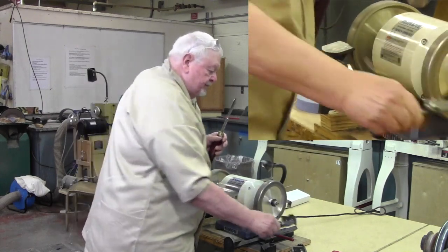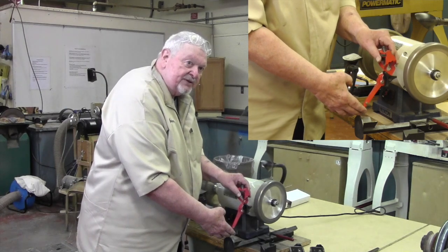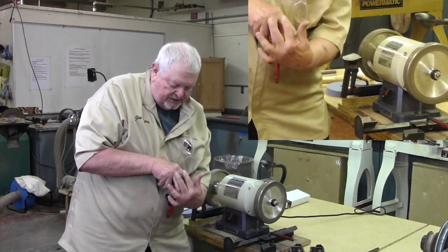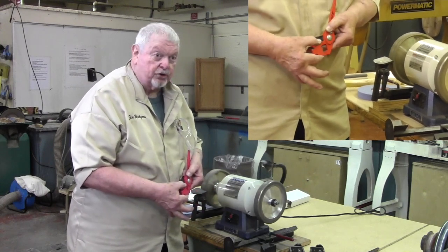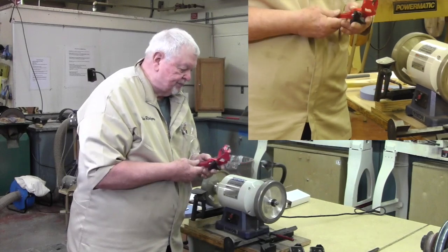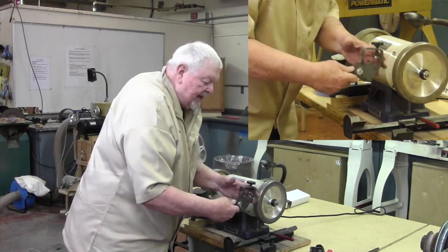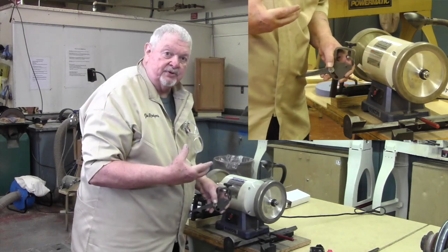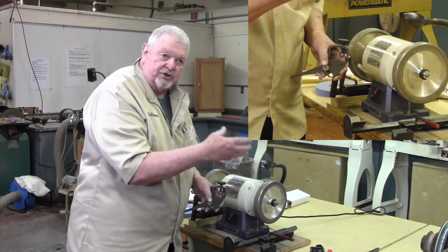I have two fixtures, one for each gouge type. There's also a third brand from a company in Australia called Woodfast — I can have exactly the same settings using their little red fixture. The difference is this uses two series of Vs that come together, allowing me to sharpen the smallest possible tool I own. Because this distance is shorter than on the One-Way fixture, I can sharpen tools even after they get too short for that fixture. Now the key point: the distance from the face of the wheel is adjustable, the angle as it approaches the wheel is adjustable, and the projection of the tool through the fixture is adjustable — three sets of variables that affect sharpening, and this applies to all systems I'll show you.